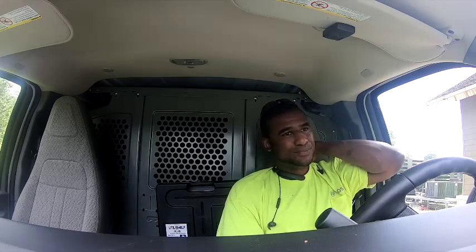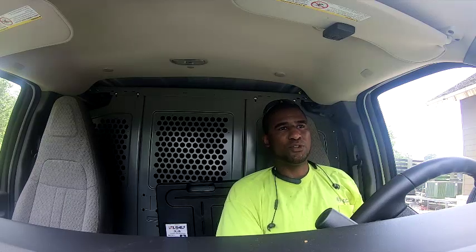So I'm doing my troubleshooting. He's sitting down on his couch, and every time I walk by to the condenser unit or whatnot, I hear him mumbling under his breath. So I'm like, man, this dude. Anyway, I go troubleshoot in the attic, and I end up finding he had a Honeywell zoning system, and the zoning board had 24 volts going to it, but the display was blank. It wasn't coming on at all, with no codes. It had a green light in the back, but didn't have any digits on it.